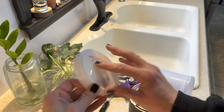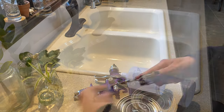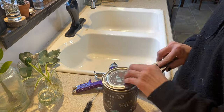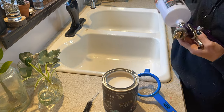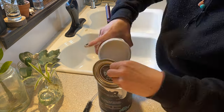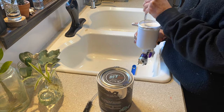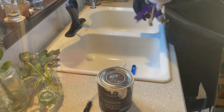On the lid you'll see me pull out this little plug. If you try to spray with that on, your cup won't be able to breathe and the paint won't come out as well. Opening a fresh can of White Swan — that's always a great feeling. When you are spraying, the ratio of your paint is going to be three to one paint to water. I'm making sure I strain my paint through a strainer to avoid getting any chunks in there. Give it a little stir and then a whole bunch of shake.